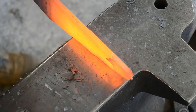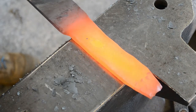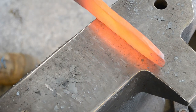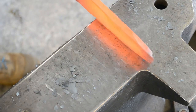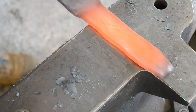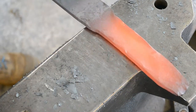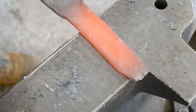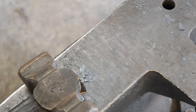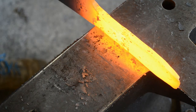The important thing to remember about daggers is that they are equal-sided — normally you're talking about an even bevel on either side. There are daggers that are one-sided more than the other, but this is a traditional European-style dagger. One of the things you have to be careful of is making sure your bar stock is perfectly even in thickness. It can't be thicker on one side than the other, because that will cause your dagger to come out slightly bent and very misproportioned.